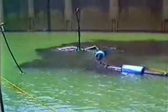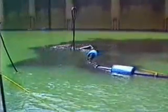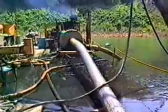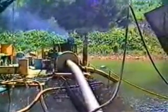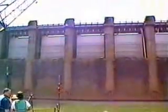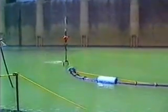It pumps into a booster pump. We need a booster pump because we have 3,500 feet of 10-inch discharge line. Our pump draws about 180 amps and we can use a straight cross-the-line conventional starter for this electric powered pump.